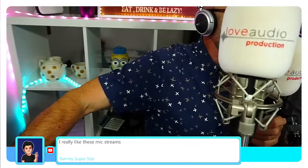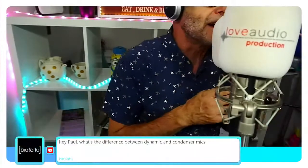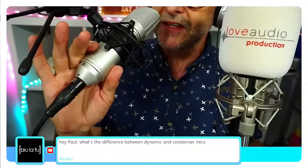Bruce from Brulafu says, hey Paul, what's the difference between dynamic and condenser mics? Condenser mics are made for studio work. So this one is a condenser mic. It's got an XLR cable at the bottom and it uses 48 volt phantom power supply from the mixing desk or from the preamp in order to make it work. If that was turned off, you wouldn't get any sound out of it at all, okay? But a dynamic mic is, 2 seconds and I'll get one for you, stay there.